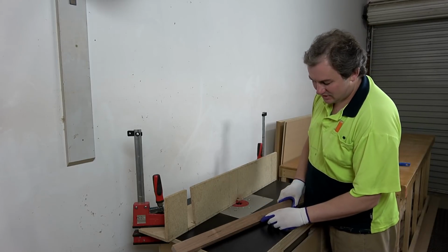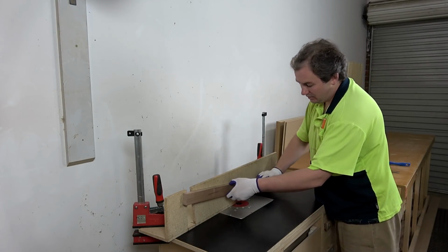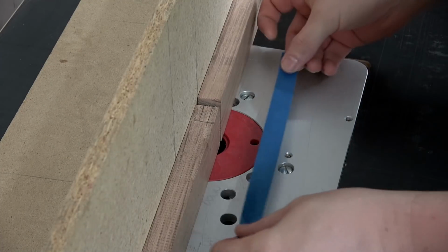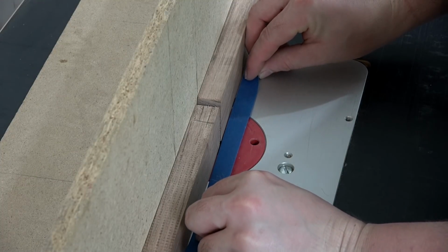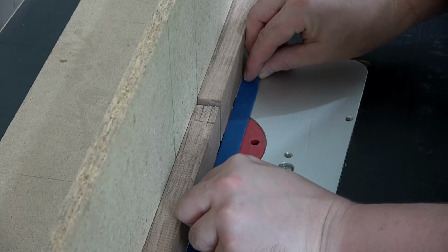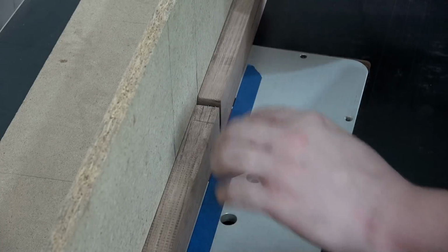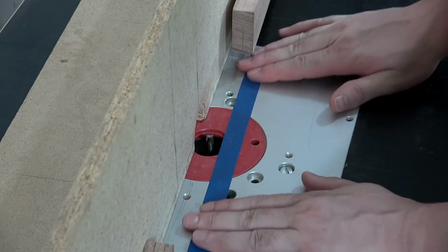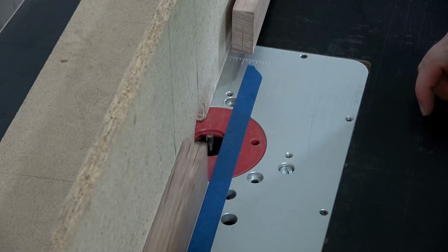And so now I've got the start and finish of my mortises marked out on the timbers here, so that when I lower this here, I need to know where to lower to. First off, I just want to put a piece of tape next to the pieces here, not under it. I don't want it to be anywhere near under it, so I want a good millimetre away from the surface. Stick that down nice and tight. Check that I'm not under the surface.